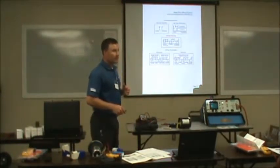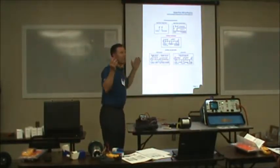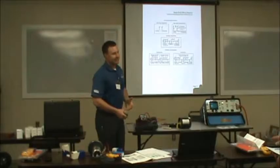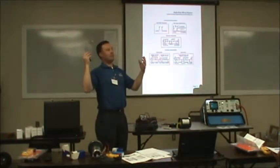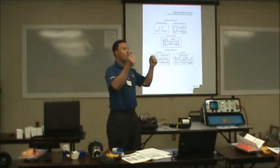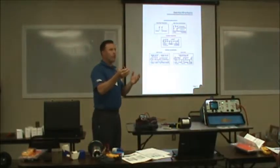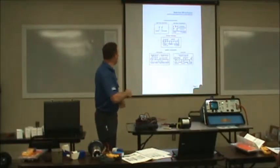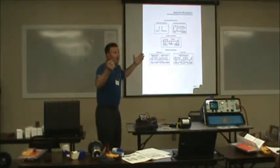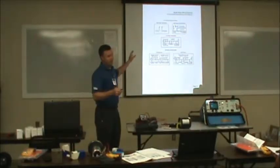And L1's your positive, L2's your negative? There's not positive and negative on single phase. It's just either one. We call it black, you call it black, white, black, red, whatever you want to call it. AC, there's no positive and negative. DC, you have positive and negative. Right, you can have a hot wire, say on 115 volt, we've got a hot wire and a neutral. It really don't matter. I can put my hot wire on four or my hot wire on one. The motor don't care.